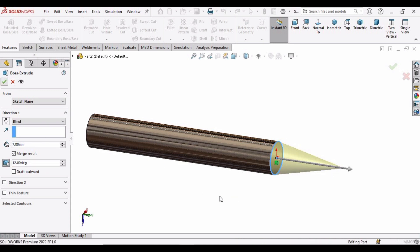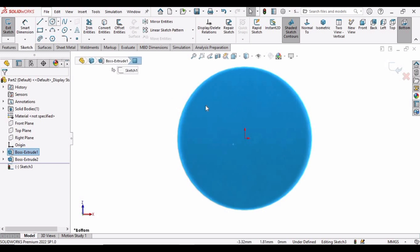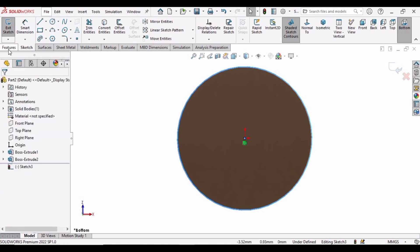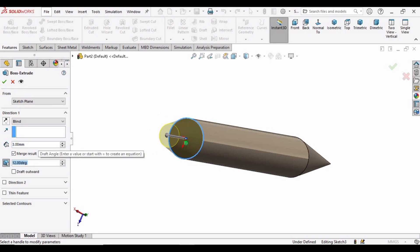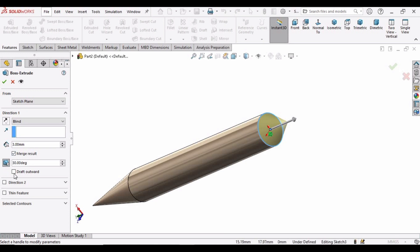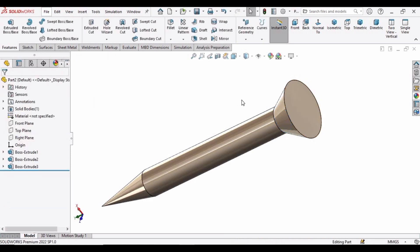Check this box. Now it's time to make the profile for the head. Select this face, click on Sketch, and make a circle, making sure it overlaps the previous one. Go to Features and select Extruded Boss again. Extrude it up to 3mm only, then select the Draft command and specify 30 degrees. The initial direction is inward — we have to select Draft outward. Here you can see the head of the bolt has been created. Check this box and the basic profile of the screw has been created.